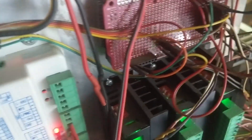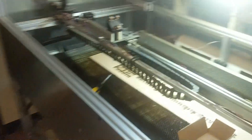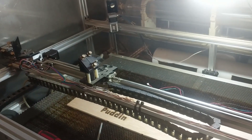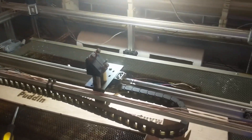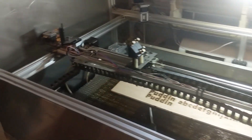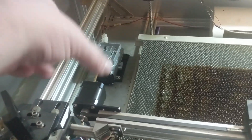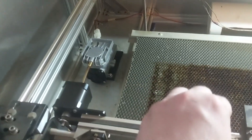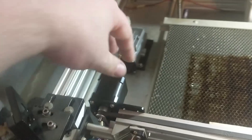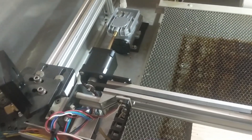Got that last one moved up, so that should be feeding at 1.5 amps now. Let's see how it runs. I'm going to get the thermal camera out and let this heat up and get toasty at 1.5. All it's got to do is just sit there. It actually has power going through it to hold its position — that's why you can't pull on it very well, it locks into position. I'm just going to let it sit at 1.5 and see what temperature it gets to.